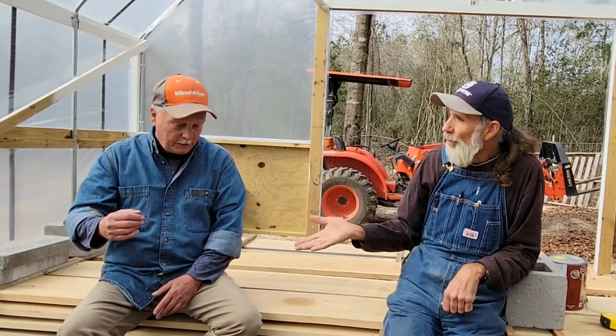You're always studying that tree. You're always studying that log. When you go to sawmill that log, you look at the end of it. The end of that log will tell you the same history that stump will tell you. And it determines how you're going to cut that wood. It determines your final product. In my case, as a woodworker and sawmill operator, I'm looking for character. I'm not just looking to run straight through grain. So I'm trying to read that log.